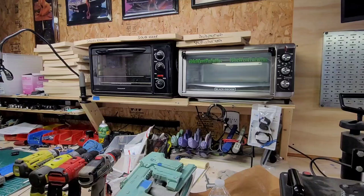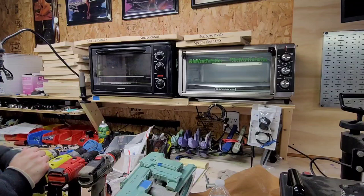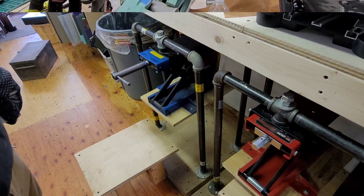And then once that heats to 350 degrees, I might go a little bit higher because we got to get in a couple nooks and crannies. But our foam is pretty good. As you can see, I can squeeze it almost all the way through. And then once that heats up, we'll use our IR thermometer, get that going, and then we'll go ahead and throw it down into our press. And we're at 360 degrees.